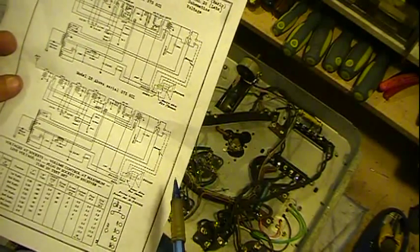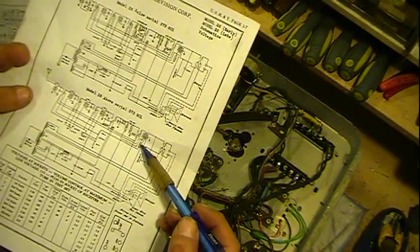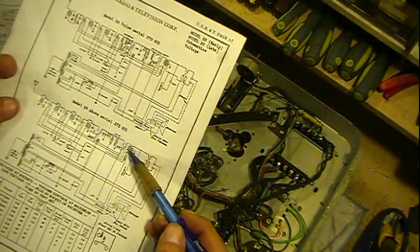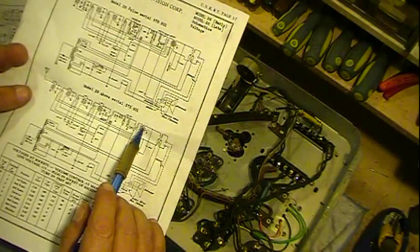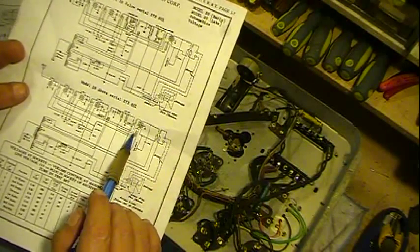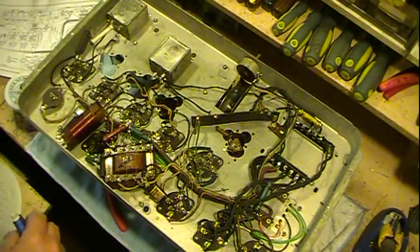And so I think it actually burned it out because they messed with it. I don't know why they did that, but what I did is I kept this resistor and added about 20,000 ohms to it in series, so I get about 28,000 ohms right through here going up to the plate, and then jumping across I put a 0.05 capacitor. So I got 27K, well 20 with 7 on this, and then a 0.05 capacitor that couples over to the secondary to feed it.